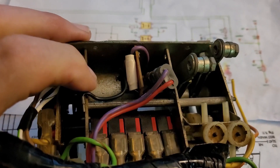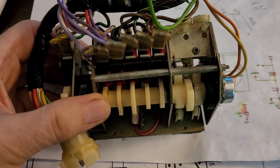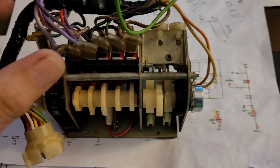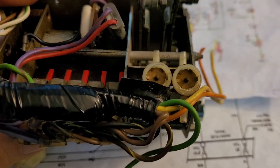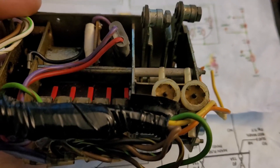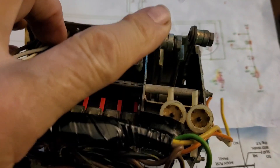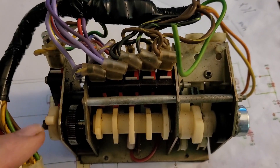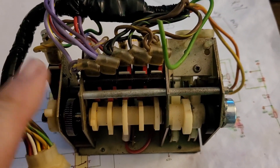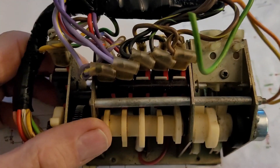What we have here is a small electric motor which drives these cams, and these cams activate switches and valves. Over here on the right hand side we have two vacuum valves. Those two vacuum valves operate the heater control valve and also the air conditioning door. Then we have two levers which operate mixing doors, and the cams themselves operate the switches — the switch for air conditioning, the limit switches for the servo motor itself, and the switches that control the fan speed.